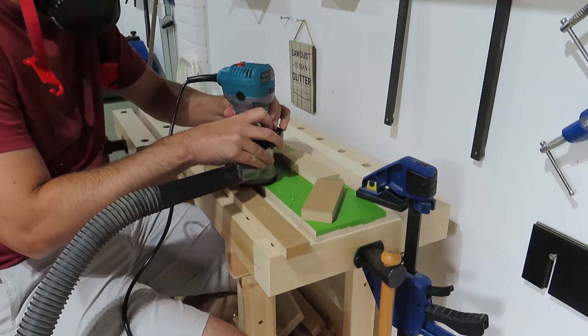Buckle up people — this is the high-risk manoeuvre. I've done this quite a few times with just MDF on its own, but never with hardwood. The stop blocks on either side of the fence give you your start and end position of the finger pull, then you just keep moving the fence back after each cut until you get to the desired depth. Here I just veneered a 6mm piece of MDF with some cherry and I'm going to fix it to the back so that you can see the cherry poking through where the hole is in the middle.